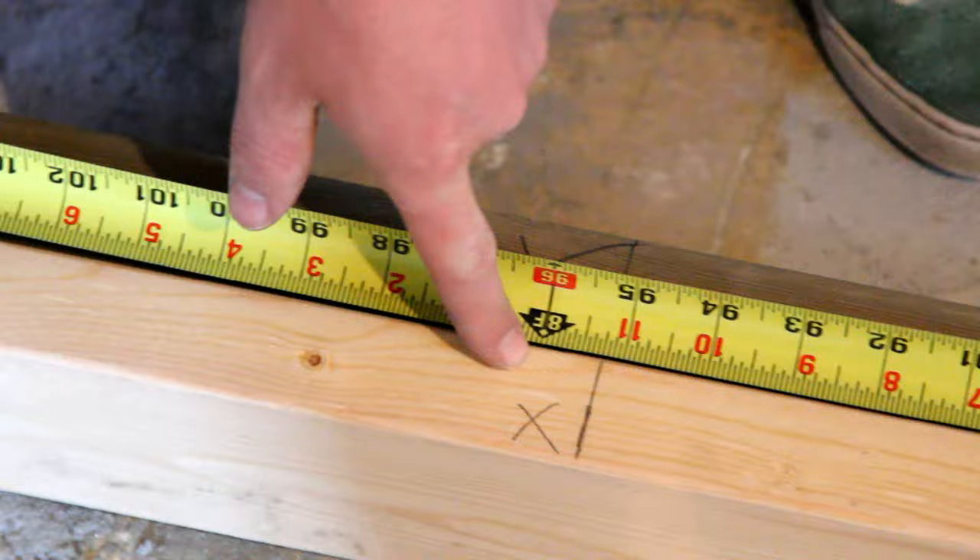Now when you throw this piece of drywall on, I'll pull you right over to the eight-foot mark. When you put a nice fresh piece of eight-foot drywall on, you butt it into that other wall, and bam — eight feet, right dead center. You don't have to cut that sheet or anything. So that just shows you why layout is important.